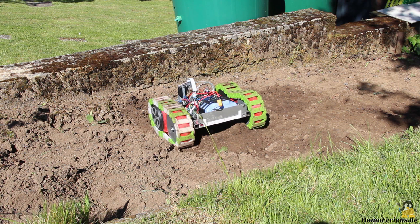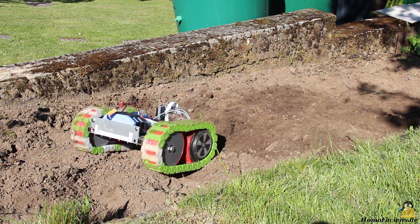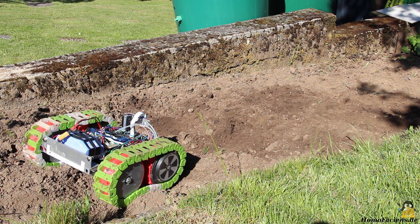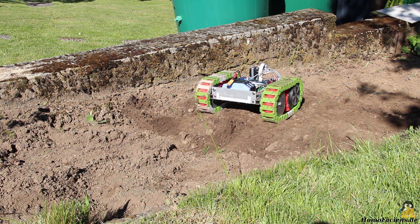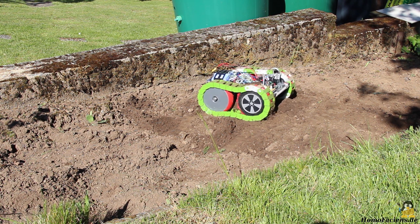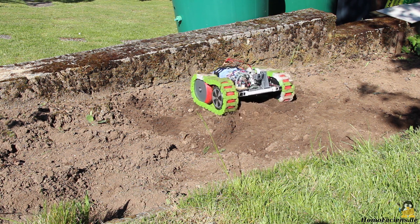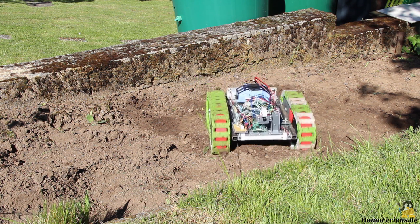The electrical input power of the motors is 250W each, which means a total of half a kilowatt goes to the drive. The advantage of the motors being built into the wheels is that they generate fairly high torque without straining a gearbox — the drives run almost without any wear. After the first test laps I gave the front wheels tires with a very rough pattern in order to convert the motor torque more reliably into movement.